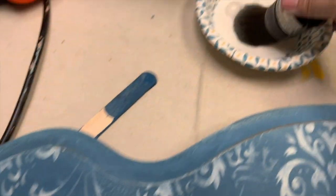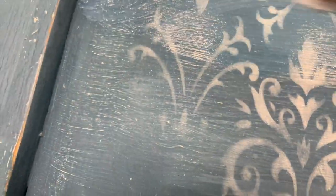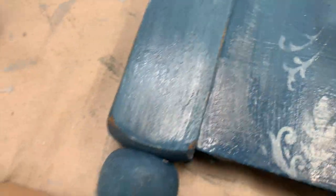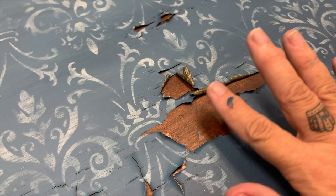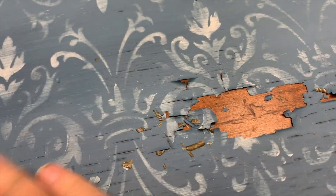Here's where I might have made a mistake with this piece. You can seal over milk paint with either a hemp oil, a wax, or a top coat, and I opted to go for a top coat. The problem is that I had forgotten that the original paint job on this footboard was also Miss Mustard Seed, and by adding the extra moisture to my paint and then having it shrink up again it really got chippy. Super super chippy. This likely would not have chipped this badly if I had used either wax or hemp oil.